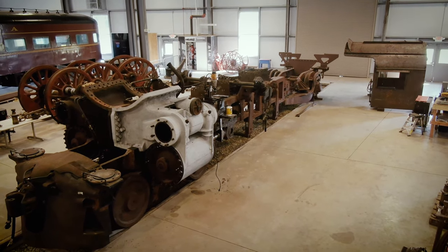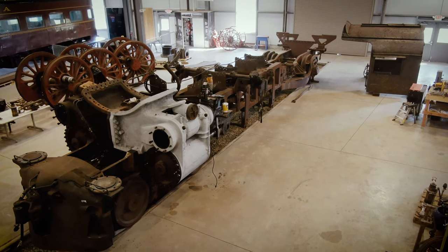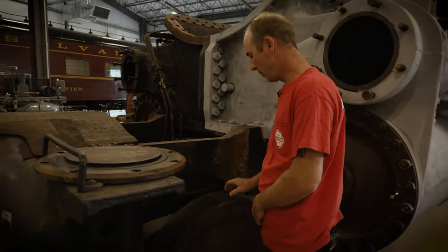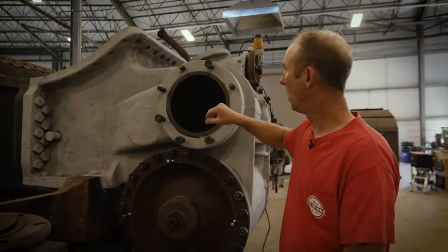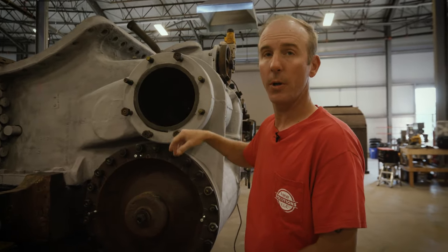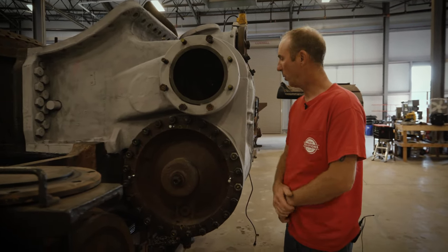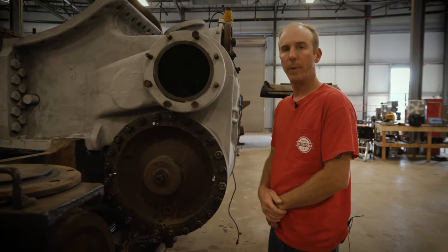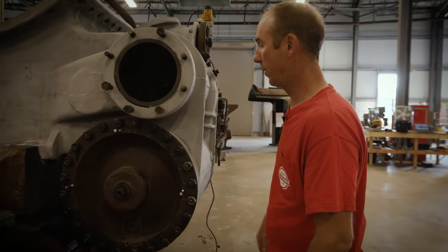There was a significant amount of work done to the frame and chassis assembly but there's still a lot to do. It did have an upgrade of roller bearing engine truck and new wheels. We have noted that the valve cages are about at their maximum life as far as their bore is concerned. Likewise with the cylinders — that's an unknown — so we'll pull the pistons out, mic the bores for taper and out-of-round, also inspecting the pistons, the piston rods, and just the condition of the liner itself.